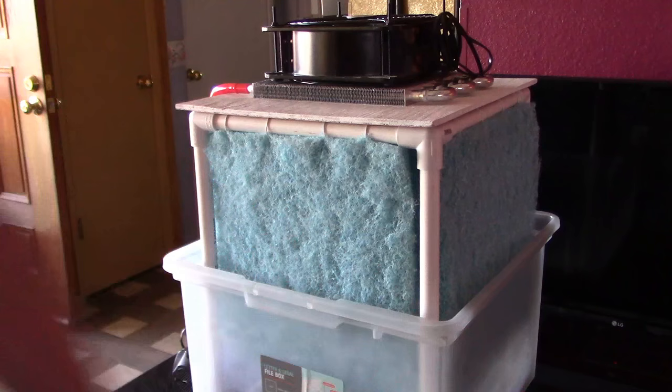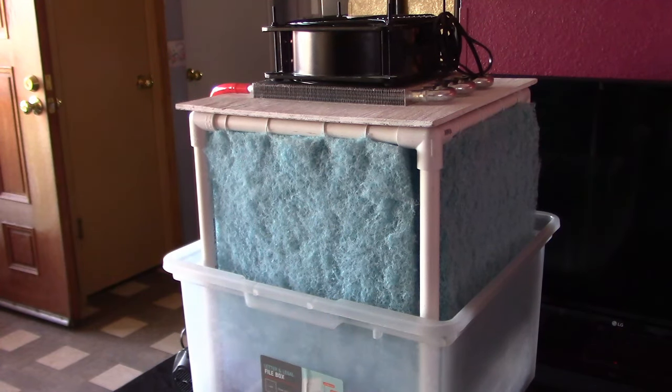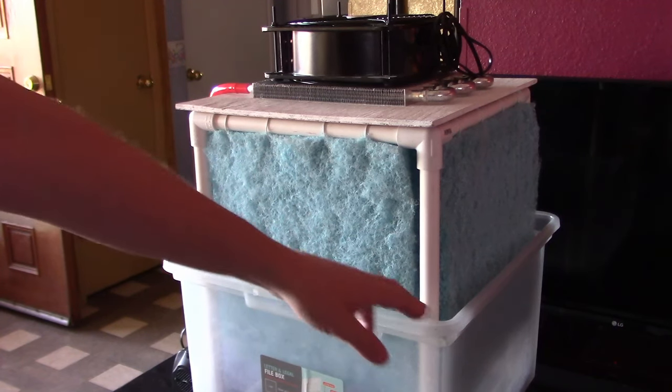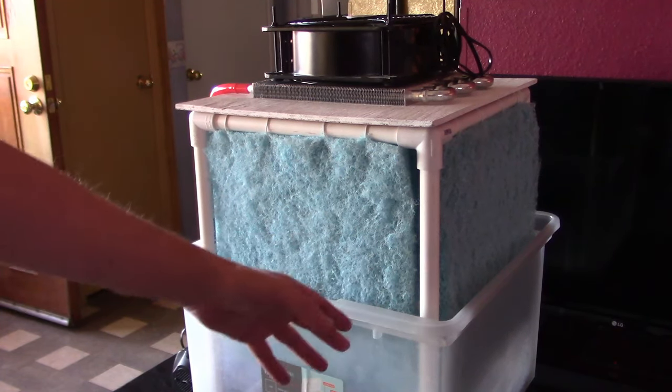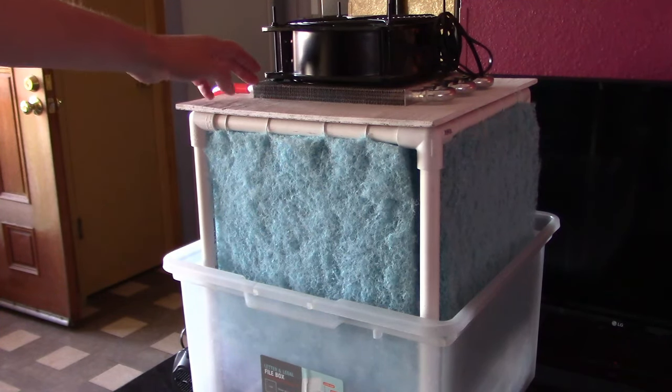over to a radiator and a fan. That gives you your cool non-humidified air. At that point, you can drop the return tube from that radiator right back in here if you want to. That'll give you just a standard indirect evap air cooler. But if you can, use the second radiator, make it a two-stager.